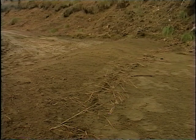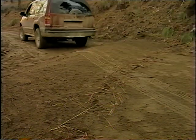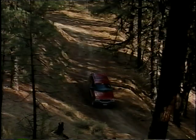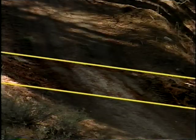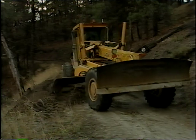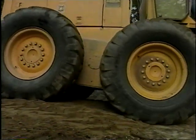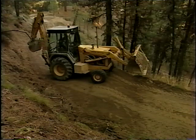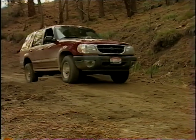Earth and water bars provide very poor driver comfort and are drivable only by high-clearance vehicles, so install them only in areas with little or no traffic. Water bars extend across the full width of the road and are skewed up to 30 degrees from a line perpendicular to the center line; they normally require little maintenance. Constructing a water bar requires cutting down about 6 to 12 inches into the travel way and depositing the material on the downslope side of the cut. Carefully compact the excavated material — the resulting bump should be about 12 to 18 inches in height and about 2 to 3 feet wide. Protect erodible ground in the outlet area, replace any removed road surface aggregate, and test the water bar to confirm it is drivable without scraping the vehicle undercarriage.